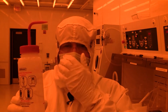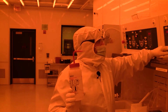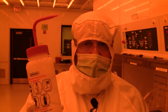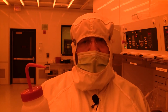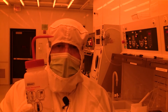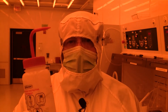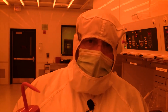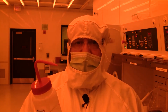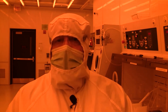What happens is you think you're rinsing your wafer off with something clean, but it's not clean. This acetone in HDPE — high density polyethylene — when you spray your wafers and let it dry, acetone has a very high vapor pressure, and you will see a residue on your wafer. So never, ever let acetone dry on your wafer. You can use it, but you have to rinse with methanol or isopropyl before the acetone dries at all. And we're certainly not going to use this with a CMOS wafer. So that's one of the reasons we end up with NMP.